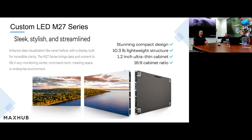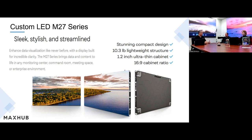Yeah, there's a rental and staging market. If you've been to a concert recently, you'll see a lot of LED video in the background. Those are a different type of wall because they get bounced around a lot. They go into ATA cases and then they roll them from one venue to the next and put them up and take them down. They take a pretty good beating. For the most part, those are usually outdoor walls that get used in an indoor environment, because the outdoor stuff is much more resilient. It can take splashes or rain or cold or hot or whatever.